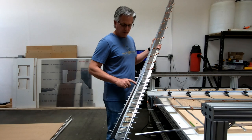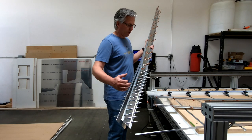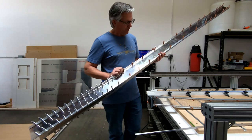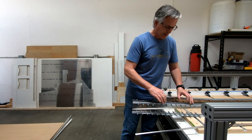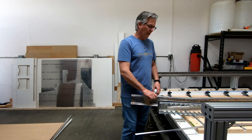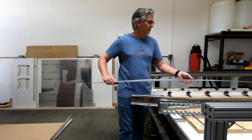Once they're riveted and assembled, there are also some rivets inside that have to be countersunk and dimpled in order for the parts to fit together properly. I've got a few more things to do before it's completely ready to be disassembled, deburred, cleaned up, and finished. Let's talk about how I got here, because there have been several things I had to be careful of and some modifications I had to make. In fact, the first set of spar caps I made I actually scrapped.